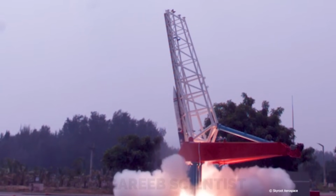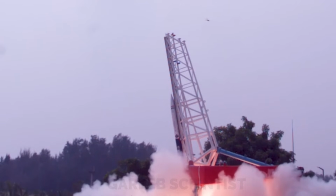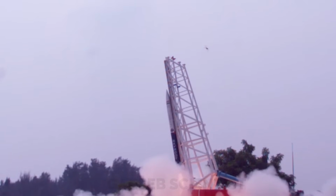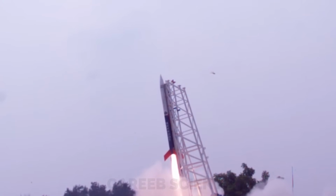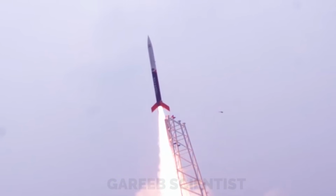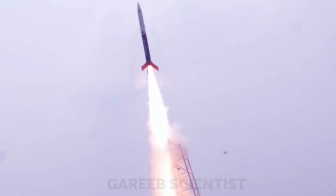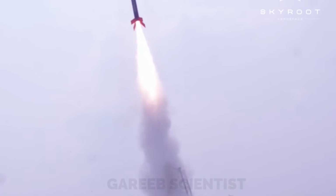But I think the simulation was very challenging because it's a highly aerodynamics-driven vehicle. And it also has a lot of dynamic characteristics: pitch, yaw, roll, linking up. Correct. And previously, if you have a lot of flights, you do a few flights and then you learn. You don't have that flexibility. You have to get the first flight right, and in a very small amount of time. We thought we would complete, but it took a lot of time and so many simulations. I can't believe how many simulations we have done on thermal aspects, because it's a very fast moving vehicle. The heat generated is also very high.